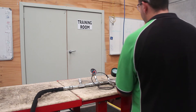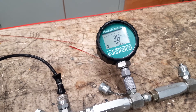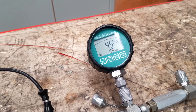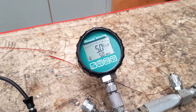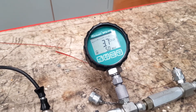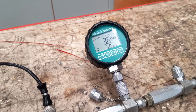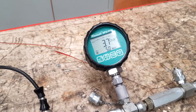With our digital gauges, they're fantastic, they work really well and give us a really accurate reading. It's really important that we don't get too tied up on the decimal points. The difference between 5 bar and 4 bar in most hydraulic circuits really isn't that big a deal. So it's important that we don't get too tied up on getting it exactly right just because we've got the resolution to do it.